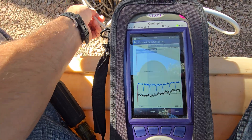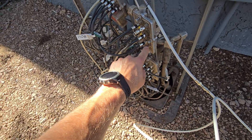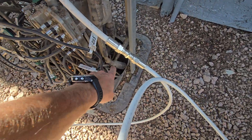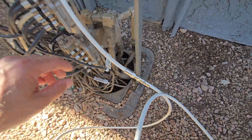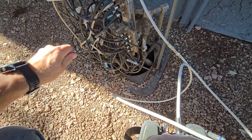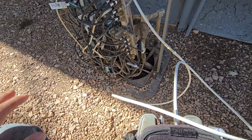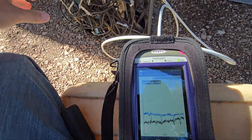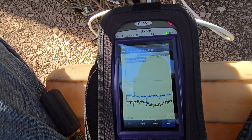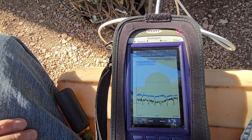You can see there's definitely some cable leakage. You want to check to make sure nothing is loose — you don't see 180s, 90s — the feeder itself could be cracked anywhere through here. You might want to wiggle some things around just to make sure nothing's loose. Sometimes the feeder can be cracked, maybe a radial crack on the hard line. Moving it around a bit so it's not stationary may produce results showing a leak indicating that LTE, Zigbee, and everything else over the air may be getting in at that frequency range.